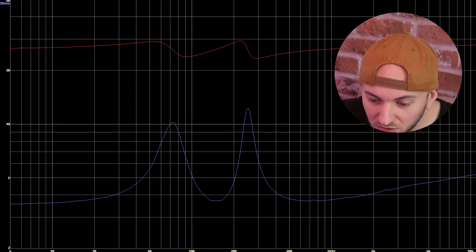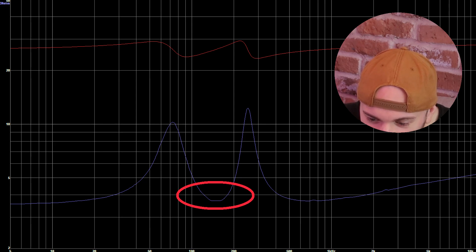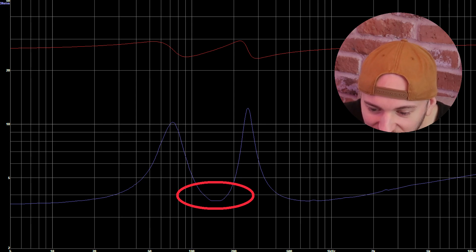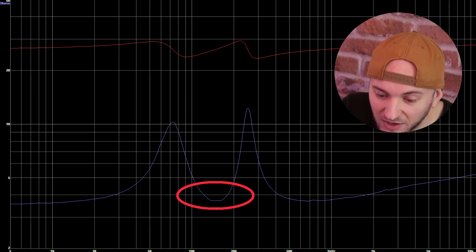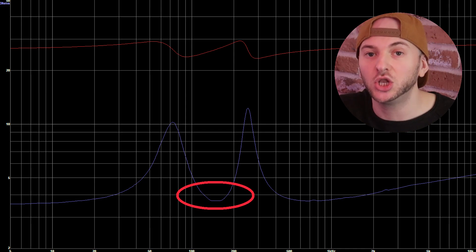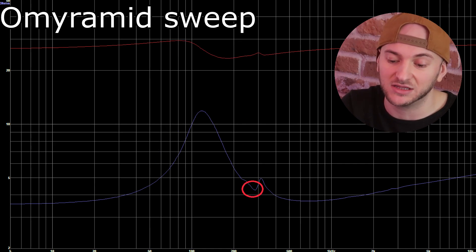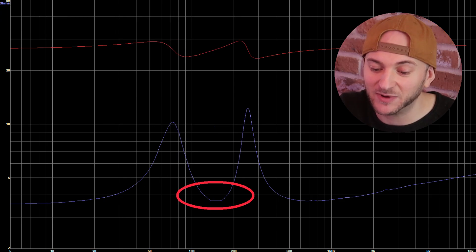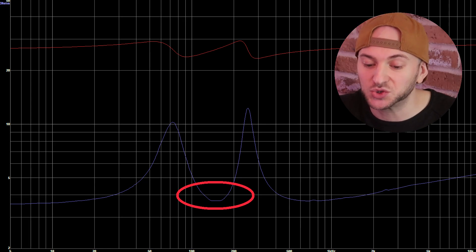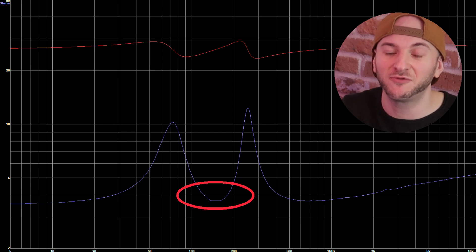And with the box being smaller, the air spring will have more of an effect on the cone's excursion when it's resonating with the frequency that the driver's playing. Thus, we get a much higher impedance spike at that air spring mode at 255 hertz. Looks like we are tuned somewhere between 140 hertz and 156–157 hertz. Interesting that it's quite flat down there — there's not an obvious peak to that value. Also, the minimum impedance read by the DATS was 3.7 ohms, which is much lower than with the Omegamid. So this is actually looking fairly promising. 150 hertz is 25 scaled hertz, which is the bottom end of the frequencies that we test. So if the port is tuned down there, it's going to perform well.